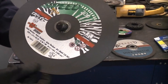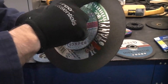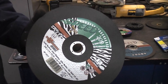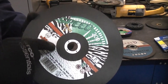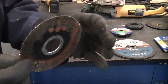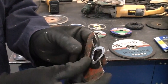This is a 9 inch thin stainless steel cutting disc, although you can use these on normal steel. As the disc wears down it will get to a size where it's no longer usable in a 9 inch machine. But that doesn't mean you should then take it off and use it on a 4.5 inch machine because it will fit — you're going to over-speed it and it can explode. So once it gets down to an unusable size, it's a good idea to smash it and throw it in the bin. If you ever get a disc that's too small for the machine you're using, simply break it so nobody else can use it.